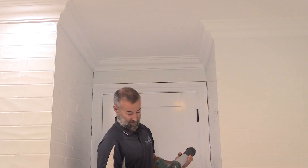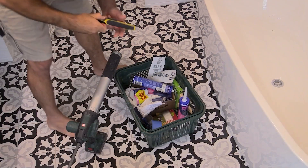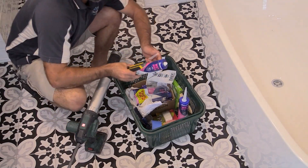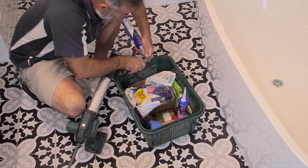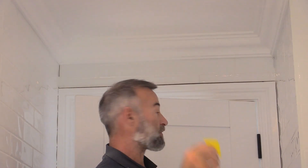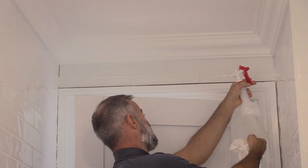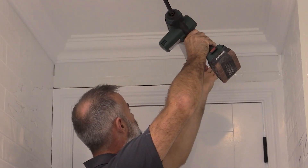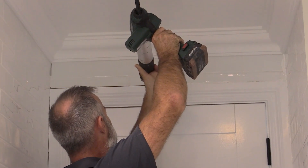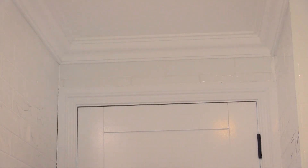Hang on — that's gray, not white. That one says light gray. These are the ones I want — white. All right, let's try that again with an actual white. Slice the nozzle at a slight angle. I've got an applicator with a real square corner on it, so we'll use that. I'll give it a bit of a spray with soapy water and spray the applicator too — that just helps.